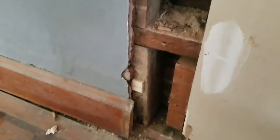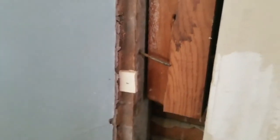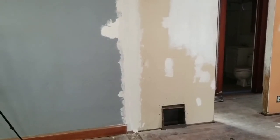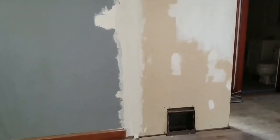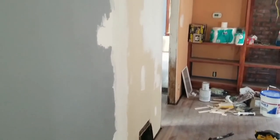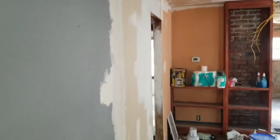I've got shims here, here, here, here, and here. As we come down the wall, it actually gets thinner to five-eighths of an inch, so there's a thinner shim, another thinner shim, and another thinner shim. I've got little dots marked right here because when I put the drywall patch in it'll cover this whole area, so on both sides I've marked where I can put a screw — just little dashes — and then I'll cut this piece and screw it in for the patch.